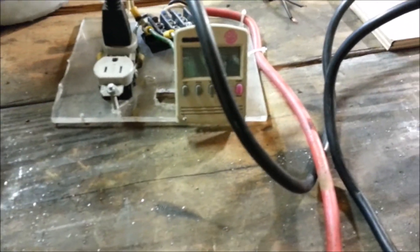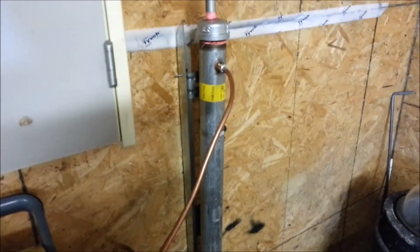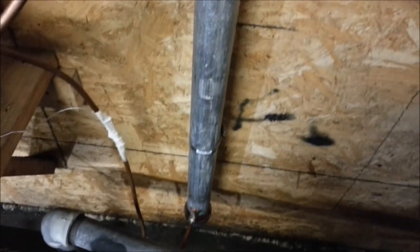We are at 135 watts of blower power here. The total power of the system — doing some quick math — I'm at 447 watts to run that fan on high, that pump on high, and that blower at 135 watts. So definitely not bad. I'm getting about 5000 watts of heat for 447 watts of power. I did the calculations on this, determined the flow rate of the device, considered the volume, and the calculations show that this thing changes itself out once every two minutes.